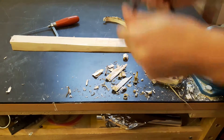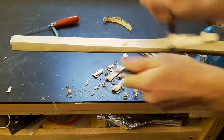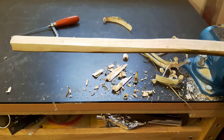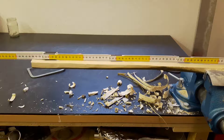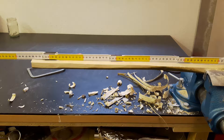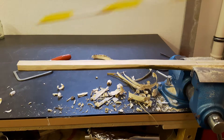There are different ways and different types of bows. This is actually the simplest bow because it's made out of a single piece of wood. It's not a composite bow, which is made out of wood and some kind of animal-based glue, or a compound bow which is carbon or something like that. I'm trying to get the center of the bow, then go 10 centimeters to the left and 10 centimeters to the right — that will be the position of the grip, the handle where you hold the bow while shooting.